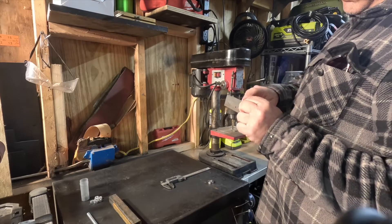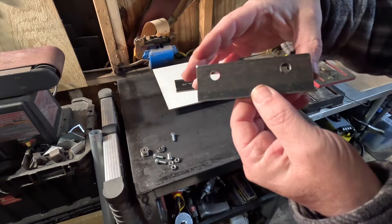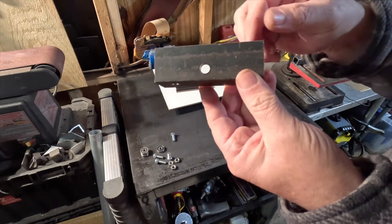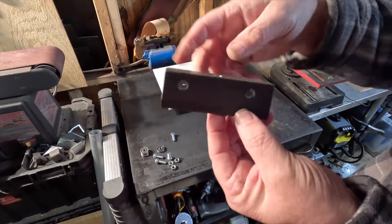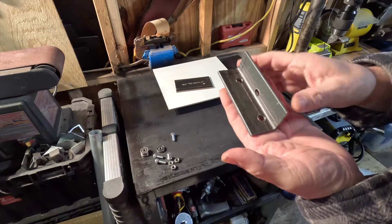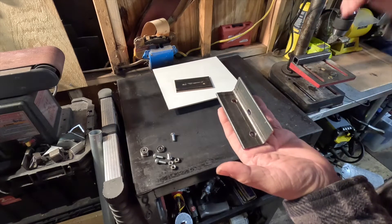I don't know if the rest of you guys are like me, but I can't find a sharp drill bit to save my life. All right, so when you're done you're going to have holes running straight across your scribe line, which for us was 10 millimeters in on both sides. Now imagine that you're going to make a rectangle out of one and a quarter inch angle iron, which is going to be the bottom of your toolbox that the toolbox sits in.